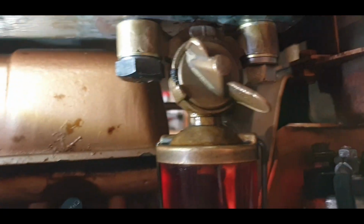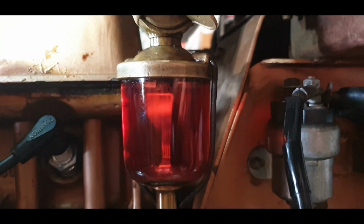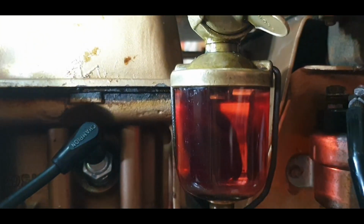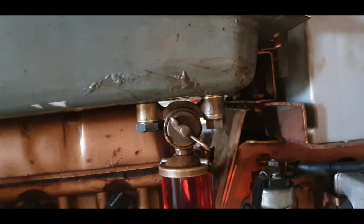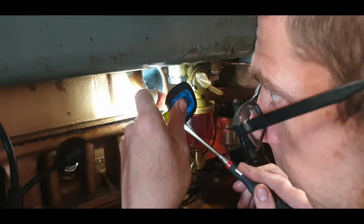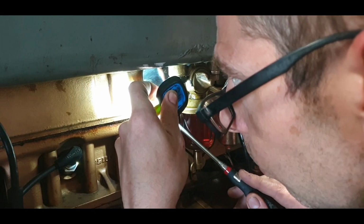This other side there, that never seemed to give any bother. It never needed to be tightened that much. I have the fuel turned on there, filling up the carb, the petrol. And looking at this here, because I had kerosene on it last, I will have to drain to start it, but that's okay. So usually what I do is, it's in behind it that usually leaks, if I'm not mistaken. So what I do is I grab my mirror here and I just have a quick look in behind there and see what are we looking like, because I wasn't very hopeful, to be honest with you, because it's not wide enough